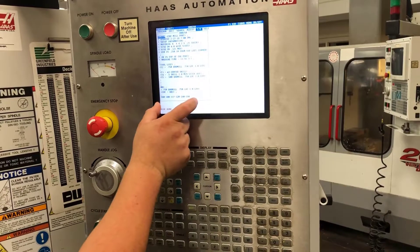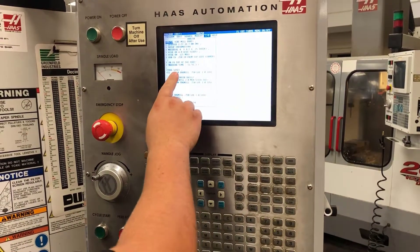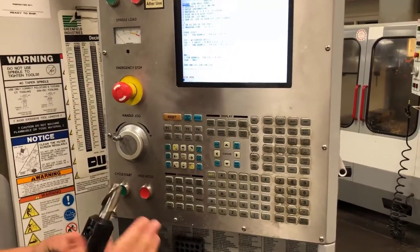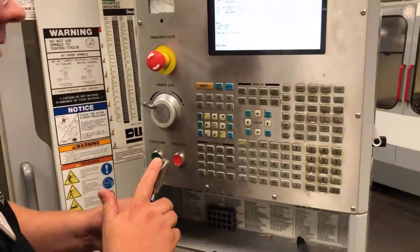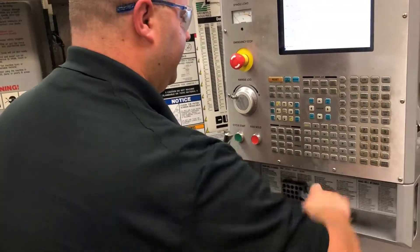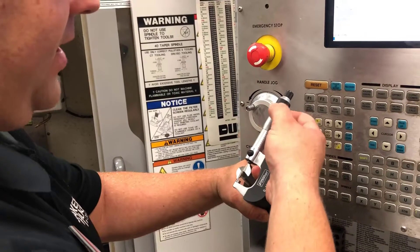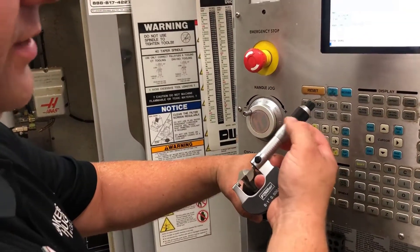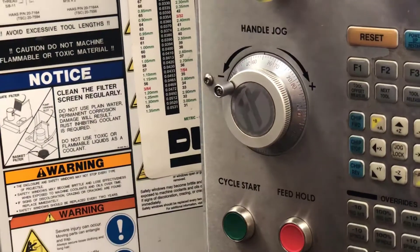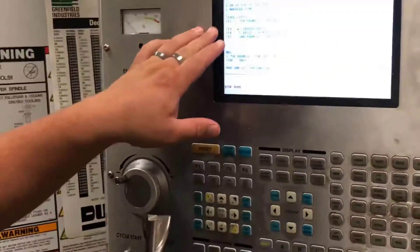For this demonstration I am actually going to be using a one-inch end mill instead of a three-quarter because that's what I have on hand. Before I load this into the machine, I need to check a couple things. I want to check the outside diameter of this end mill to make sure it is close to one inch, and if it is not, how close is it? I'm going to use my micrometers and find that I am pretty close to one inch, getting the furthest outermost points of this end mill. So I'm going to load this tool into tool 12 pot for this example.